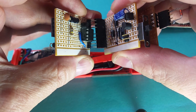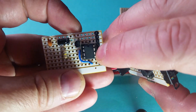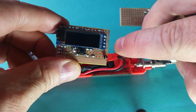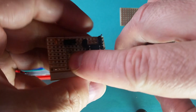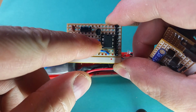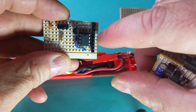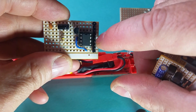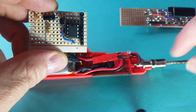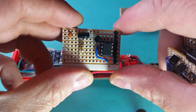I've got a little bit of circuit in there so I can read the analog-to-digital converter properly. I've got a PIC microcontroller in here — it's only an 8-pin one, a very basic one, but I've adapted it so that two pins drive the LED display. On the other side, one pin does the switch, which leaves me three I/O pins: one for sensing battery voltage, one for sensing the temperature of the iron tip, and the third for actually switching the heater within the soldering iron on and off. That works out perfectly.